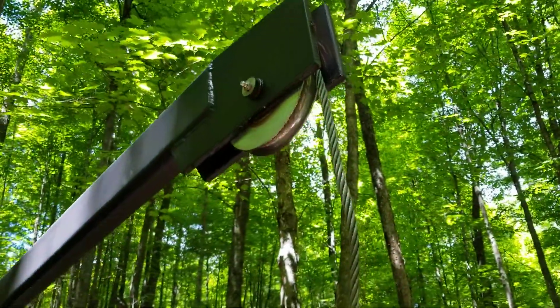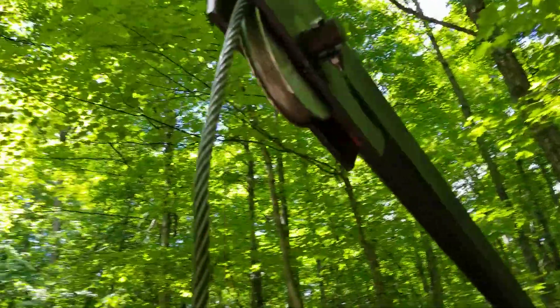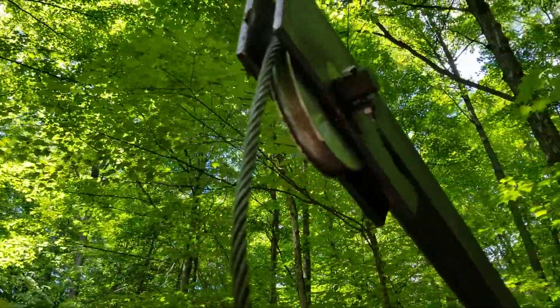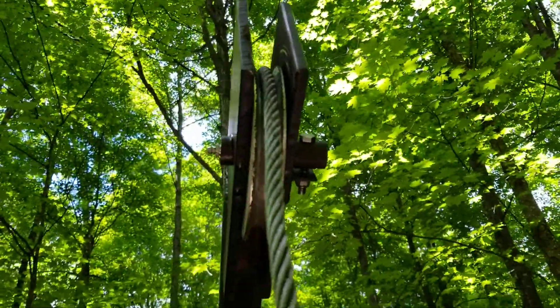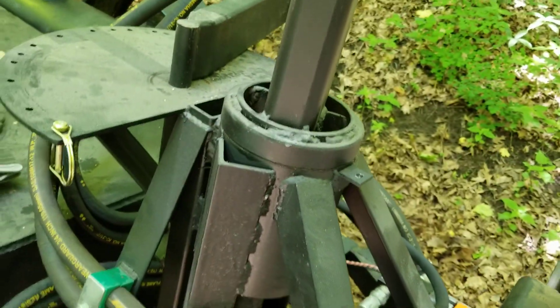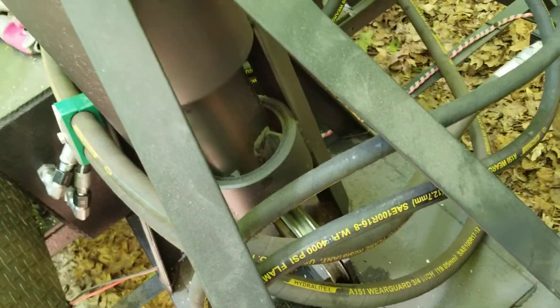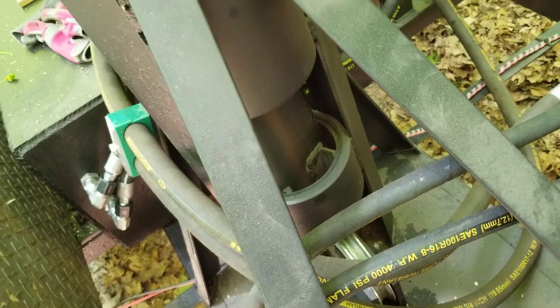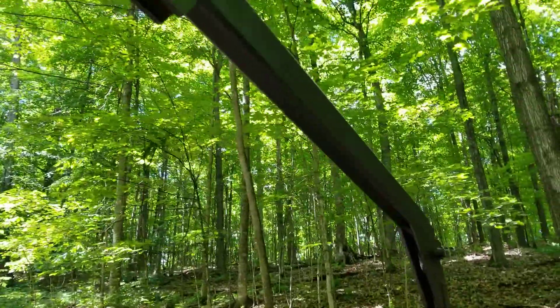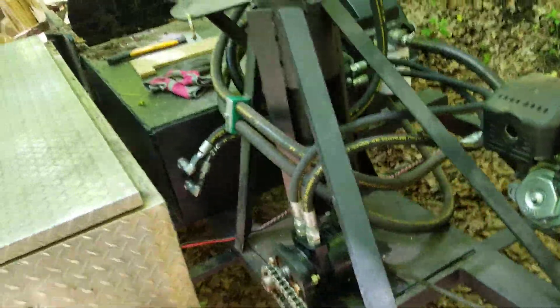The rollers — I can't remember where I got them, I think I got them on Newegg actually. I just searched "cable roller." There are some brass bushings in there and I made up the pins on a lathe and gave them a grease zerk. It may have been overkill but I'm not one to know exactly how much I can get away with. I got some bushing stock out of the junkyard at the metal supply place and made those up. The rectangle tubing is quarter-inch wall and so far everything's pretty good.